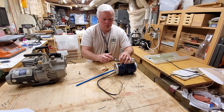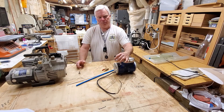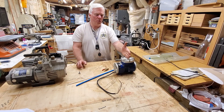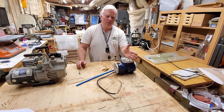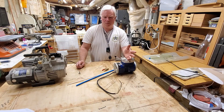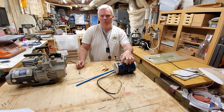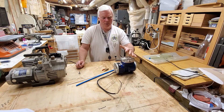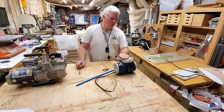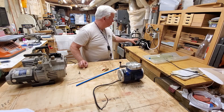There was a little gauge here but I don't know where I've put it. I stopped using this pump about a year ago. You just dial it to 8 to 10 inches, hook your little hose on there, and it runs continuously for the two and a half or three hours that you have the wing core in the bag. That's great if you're doing a low number of wing cores, otherwise it's going to run all day long. It never got warm or hot, but after a couple of years it sounded like it was about to throw a rod, and I upgraded to what I'm using now.